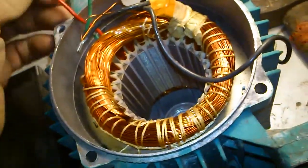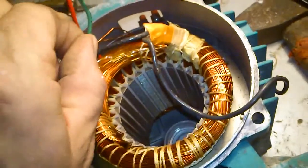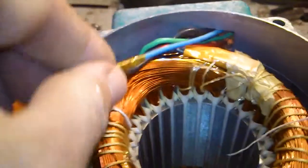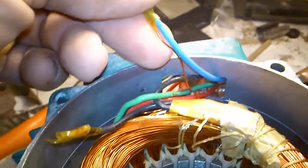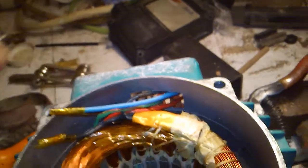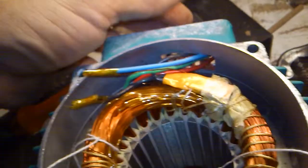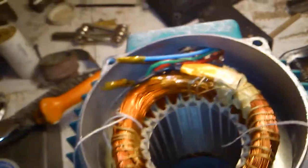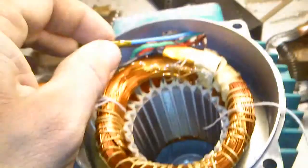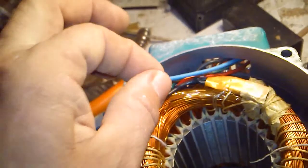Basically I connect this one here and this one will take the place of the other. One of the cables is still connected to the black one — the thicker one — and the thinner one is connected to the new piece of blue wire. I decided to do it like this because in the future I might want to run it both ways, so it's better to have four leads. I isolated the connections with kapton tape.